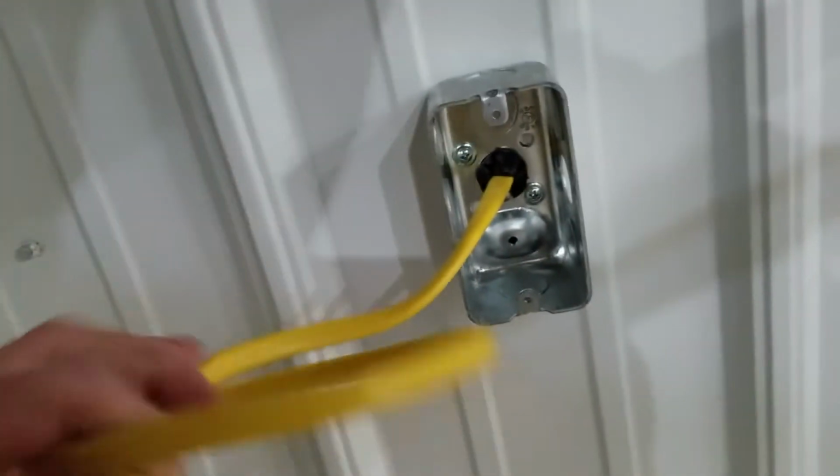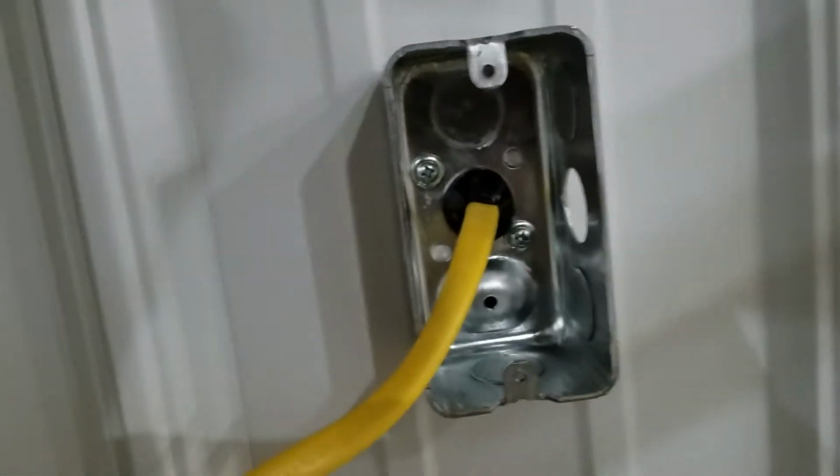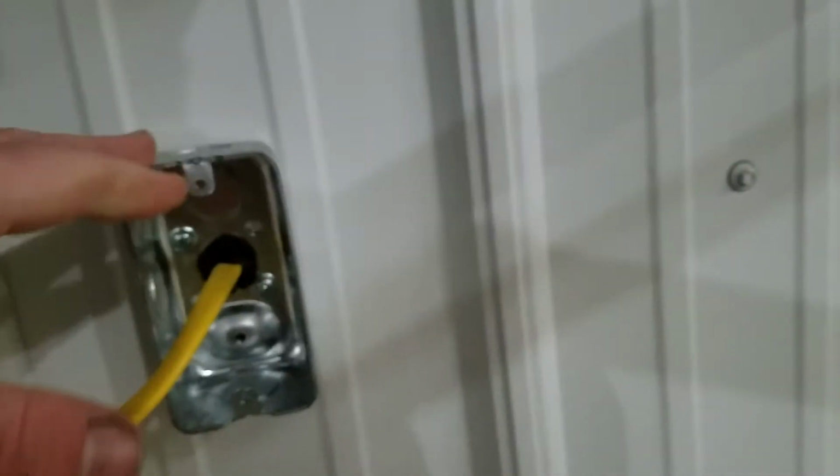I'll put a nice clamp right here to hold it firm, and then eventually this will be water service when we get there. And here's an example of how the boxes work. I drill a hole in the tin, and then you can see by looking at the screws that this is right in the middle of that board. I drill a small hole through, bring the wiring through into a bushing, and then 2 screws right into solid wood. Now this box is the feeder for what'll be this line of outlets going down this wall.